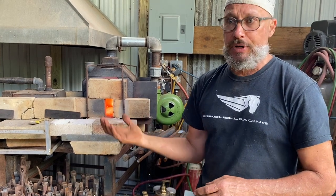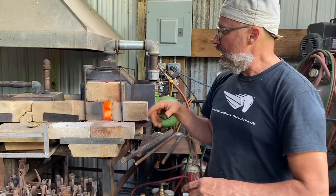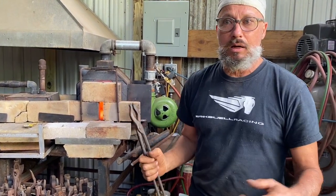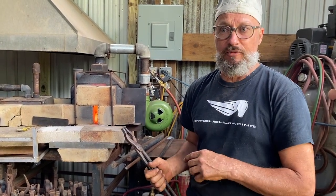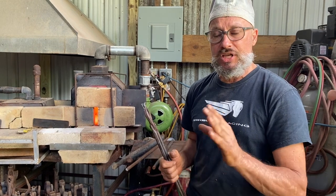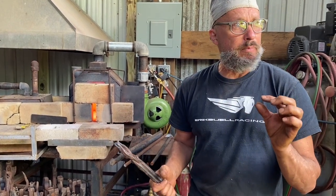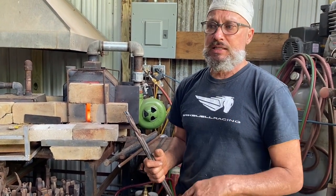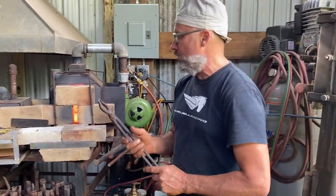The energy that's created from the ignition of your hydrocarbon, your gas, and your air. So initially you're heating the chamber. Subsequently, the chamber's heating your steel, with the addition of the flame that's coming off of the burner. So protect yourself from Kaowool or any loose refractory, powdered refractory, or airborne refractory, just because it's dangerous to lungs and lung tissue, that kind of thing.